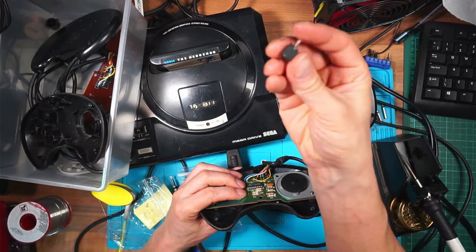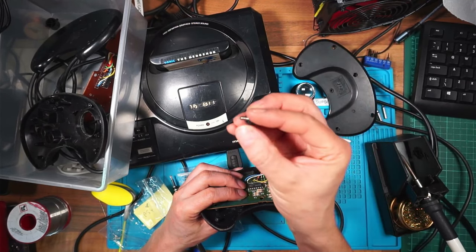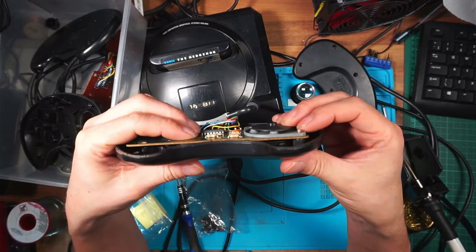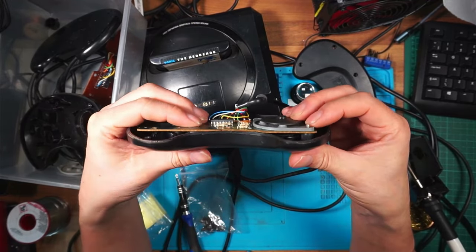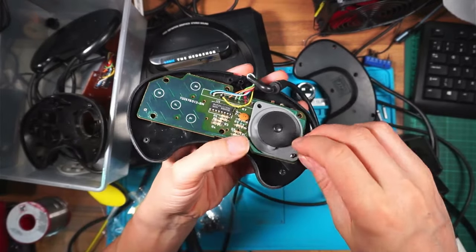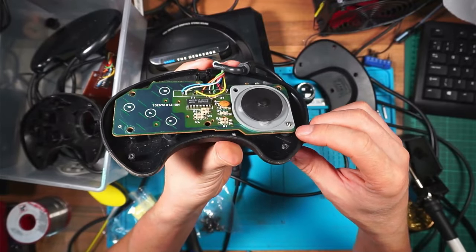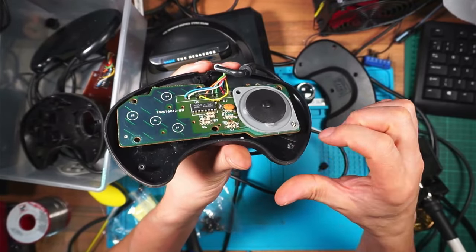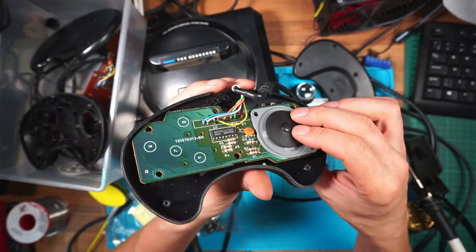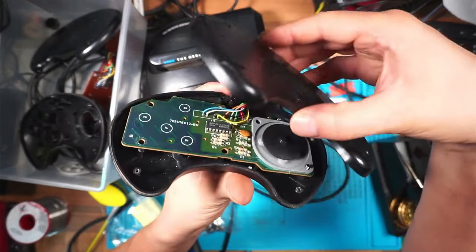There's a post missing from here which corresponds to a gap here - so when the shell sits together there's nothing supporting it. That's why it feels as bad as it does. Can I glue something in? I've got a big bag of screws - this thumb screw off the back of a computer case seems to be just about the right height. I'll hold it in place and use some super glue, then build it up with epoxy.